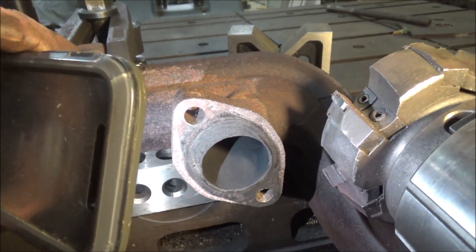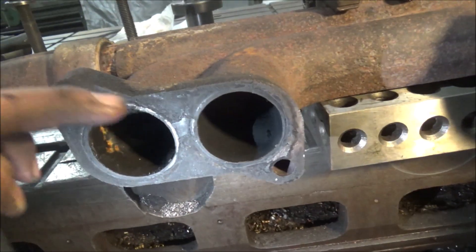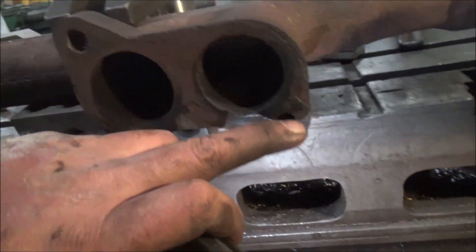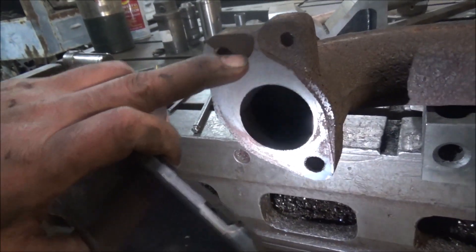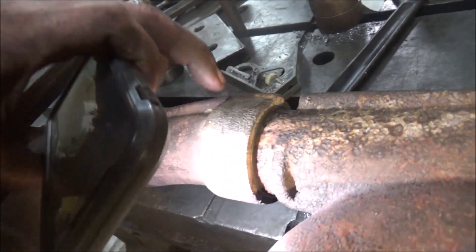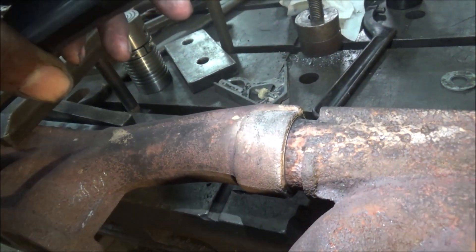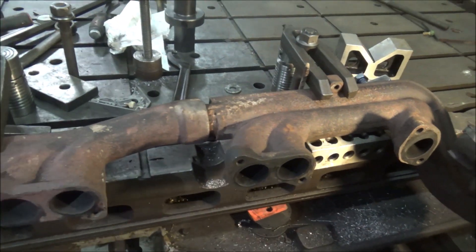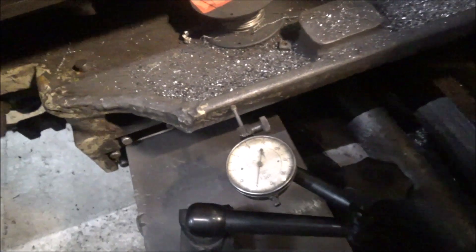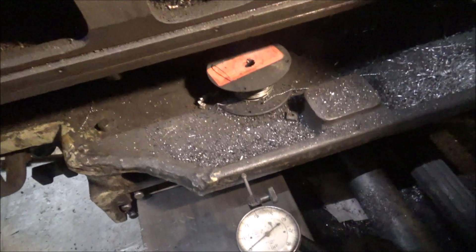Well, let's take a look at why this manifold is in need of repair. It's just barely touching right there on that one; this one here is not touching. Right there at that bolt hole it's fairly scratched. This one's touching top and bottom; this one's touching quite a bit on the top and just barely on the bottom. This has the new slip-fit bushing that I put in there — I bored that out after I put it in. Let's take another ten off here and see what we get; dial in ten on my table and see what that does.